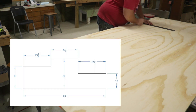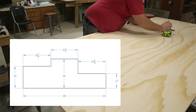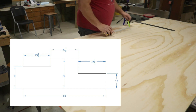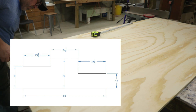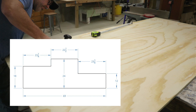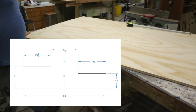I began by laying out the cuts according to the drawing you see here on the screen. If you notice, the center section is a little narrower than the other two — it will have an overhang on both ends. So the top will actually be 24 inches long, and so will the two sides, making all the tops equal size. I had to adjust that middle to account for two overhangs instead of just one. Once I laid this out, I was ready to start cutting.